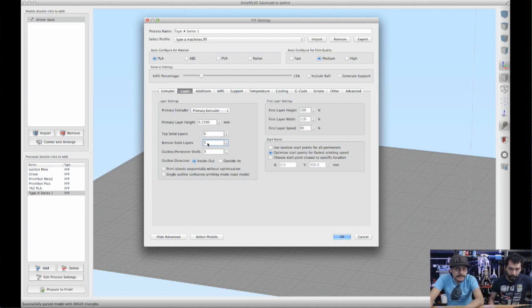Oh yeah. Yeah, 5 and 6 tend to work really well, especially with copper fill and Ninja Flex. The Droney Trophy actually needed to bump it up from 3 to 6 just to give it that extra bit. And I also increased the shell count here so that it could withstand hours of tumbling, because that's what you're going to do with these parts, especially with bronze fill. You can throw it in a tumbler. You want to have a nice thick layer height. Okay. Anything else here? Maybe first layer?